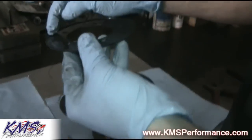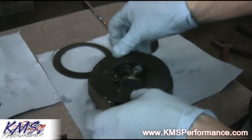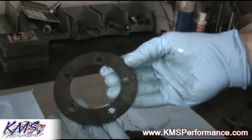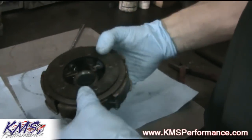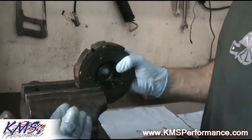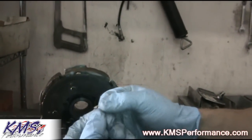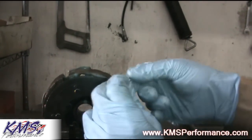Do the base plate first — you want to make sure the lip faces up. Then we have a spring washer; make sure the conical side is up. Then we have a retainer plate. This retainer plate will be fighting the spring, so we need to go back over to the vise and compress it to allow us to install the E-clips. You'll notice E-clips have a sharp side and a smooth side — you want the sharp side out.